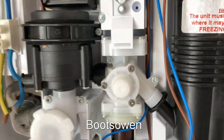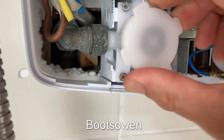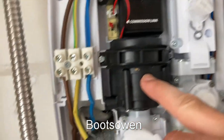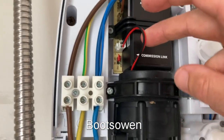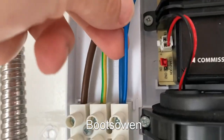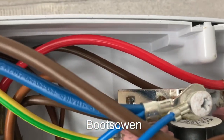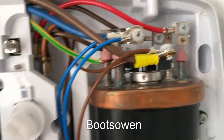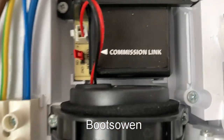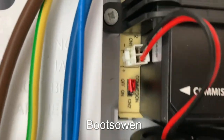That's your selector for one or two elements. And that's your flow regulator down here. So the water's coming in here — it's got the thing that says inlet there. That's the pump, so it looks to be running on DC. I presume that's some kind of transformer, with power coming in neutral straight off the mains, live coming off the live side of the thermal switch. Nevertheless, I think that's just a transformer in a box and a rectifier, because it's seeing plus and minus there.